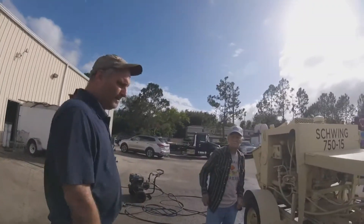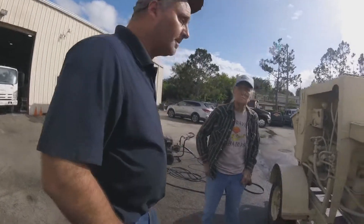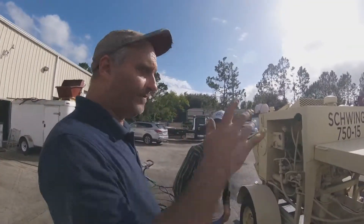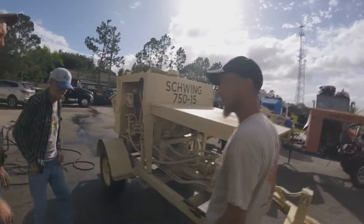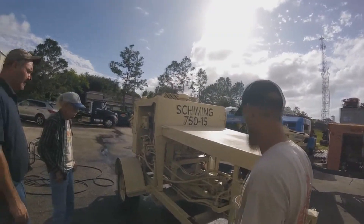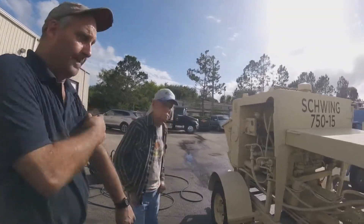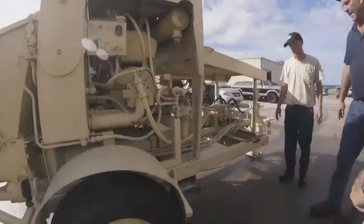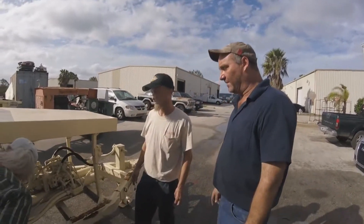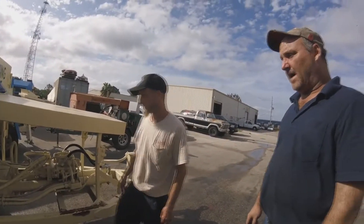For the water box, use water only — not hydraulic fluid and not slick pack. Don't fool around with that; it just makes a mess. It's designed for water. Dump it every job, close it up, and wash it out until the next morning. The benefit of water is you can see it every day — you drain it and if there's oil in it, you know the packings are going bad in the dip zone. You wouldn't know that with oil or slick pack. I've evacuated the hydraulic system several times and found slick pack in there — that's what caused the packing failure from sucking through.